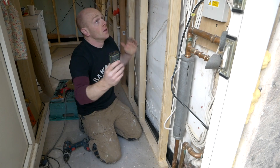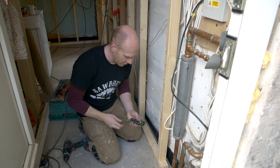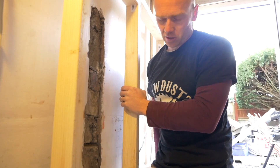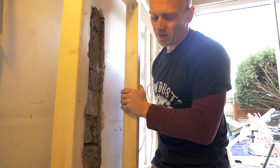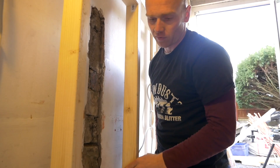As with the last video, it's a sloping ceiling so every stud is different. A load of people asked about the tool I use for this in the last video, so I'll stick a link for it below. These three-inch studs are a little bit weak and wobbly, so I'll tie them into the wall at a couple of points — that really helps. That's another reason why I've gone with two noggins on this wall.